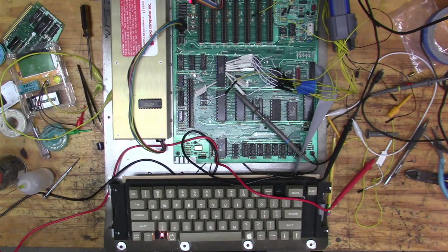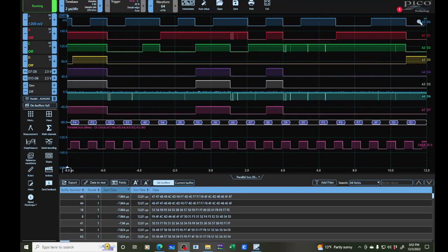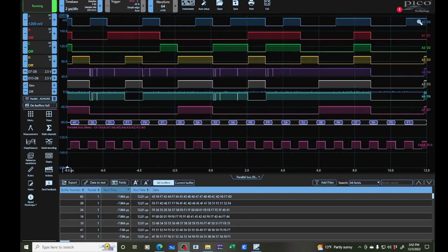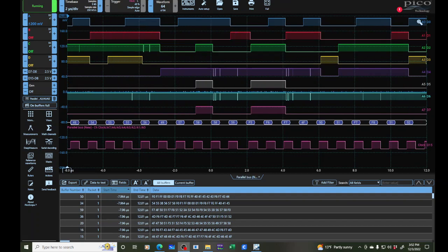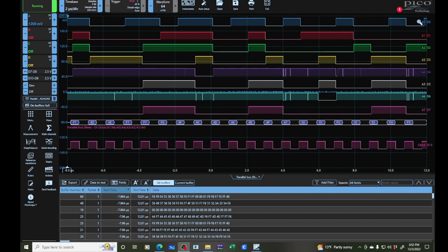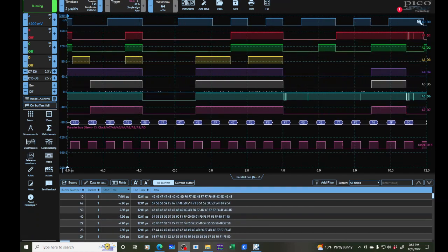And now it starts every single time. And here, let me show you. So here I am running. I'm going to power it off. See it stop. On. Comes up right away. Off. On. And here's reset. Reset. Release. So we're coming up every time. So I really think it's probably that ROM is bad.